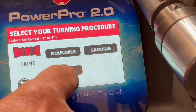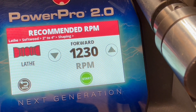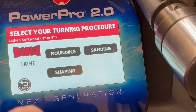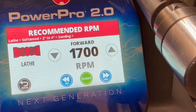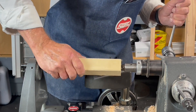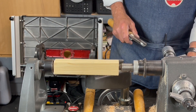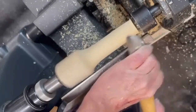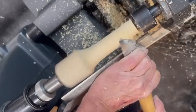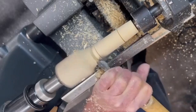After you've got it rounded out, it'll set your speed for smoothing, shaping, and decorating using your beads and coves. 1230 RPM, it says, for two to four inch thickness. In fact, the machine even sets your proper sanding speed — another one I thought was too fast, but it turned out to be perfect. I'm going to follow exactly what the speed chart says at 990 to round this two-inch piece of pine out. When I was actually smoothing and shaping, decorating the piece with beads and coves, by following what the touch screen set for me, it looked and felt like the speeds were dead on again.